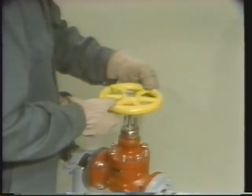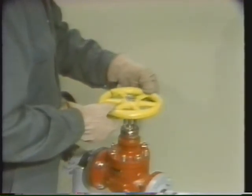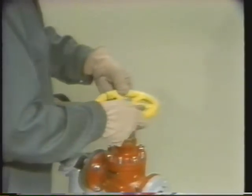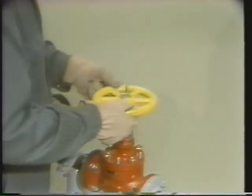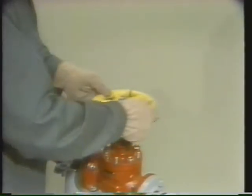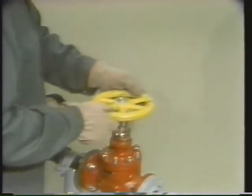The technician takes note of the position of the black mark on our lapping tool to help keep track of the stem's position. As he is turning, the plug inside is moving against the valve seat, and the surfaces are being ground so they'll mate well together. When turning the stem and plug, you don't need to press down very hard on the handle — just let the weight of the plug, the stem, and the handle do the work.